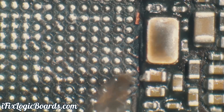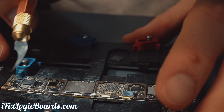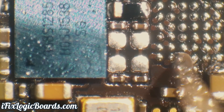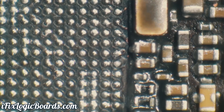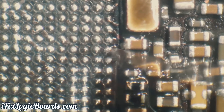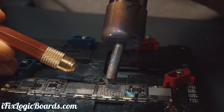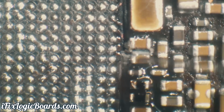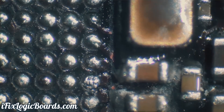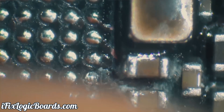What I'm planning to do now is remove this pad, clean this area here a little bit so I can run a jumper wire and let it go either this way or the other way. I'm going to run it down to under the TriStar. I'm also going to remove this pad and that should do it. I made some space here. Here's the pad. Here's the VIA. So I'm going to try to just make a cut here and try to pull just that pad.